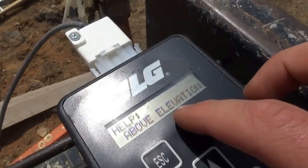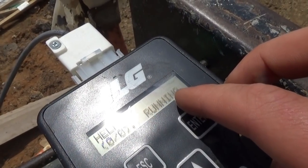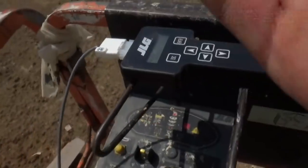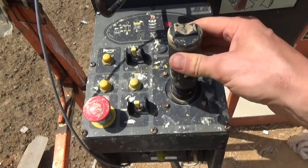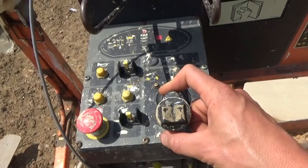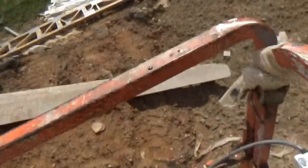Come back — elevation zero zero, so that's normal. Running at cutback, so basically it won't rev too high if you're above a certain threshold. Interesting — so now it works. Let's go back down. We have to figure out this tilt sensor problem. There's something intermittent — we had a fault for the proximity sensor that said it was always open, and we had a fault for the right rear pressure transducer signal. Could they be in the same connector perhaps?